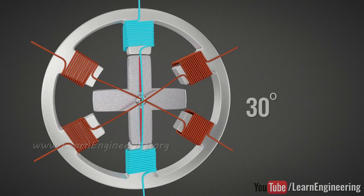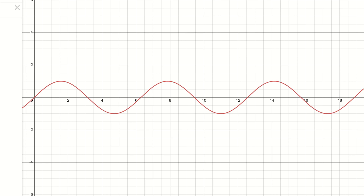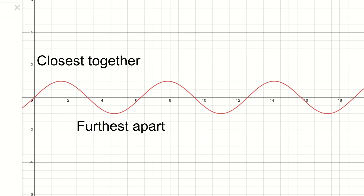We power these motors with DC, so why do they produce AC when you spin them? Imagine a graph that plots the distance between a magnet and a coil as the magnet spins around in circles. As it comes from the furthest point, the plotted line is rising, all the way until it reaches the closest possible point, at which it falls until it reaches the furthest point again. This line is just a sine wave, just like alternating current.